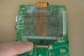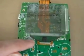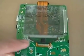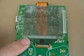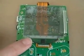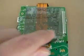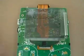From this side I take the wire kind of behind and back. I also do that because inside the Game Boy Pocket case there is a raised section on the backside, so it will push against the wire. That way, if you solder it around, those wires aren't crimped by the case itself.